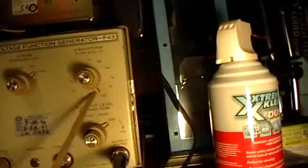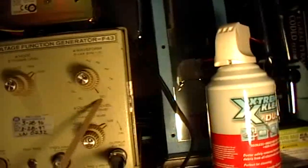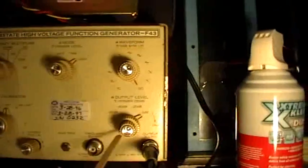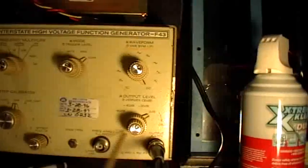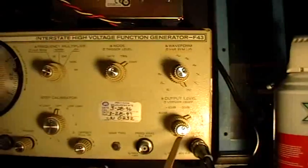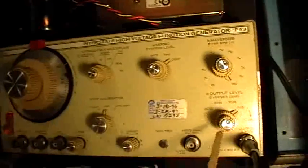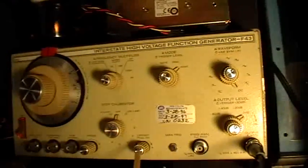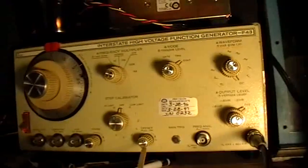this knob. But for our purposes right now, I've got the function generator set to output DC. So it's actually not pulsing, it's just putting out a steady DC voltage level. Okay, and we've got the attenuator set to 0 dB, so no attenuation, and then this knob will control the output amplitude of the function generator. And if we were putting a pulse in, this would control the peak-to-peak amplitude of the pulse. But since we're controlling DC, we'll see here on this knob, we'll see 0 to 5 volts of range, and we'll set the actual level of the DC output with the offset control.